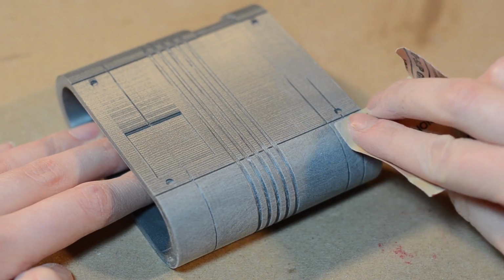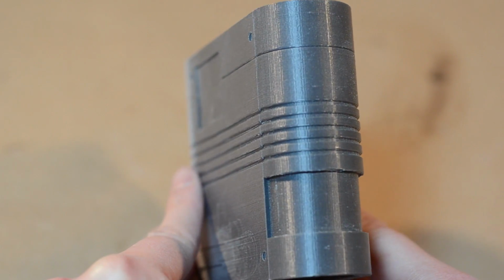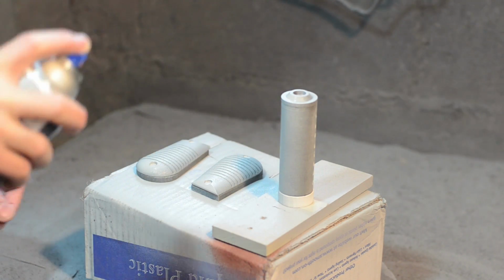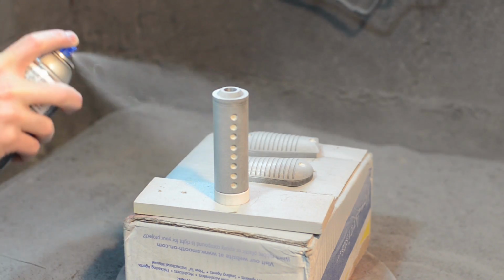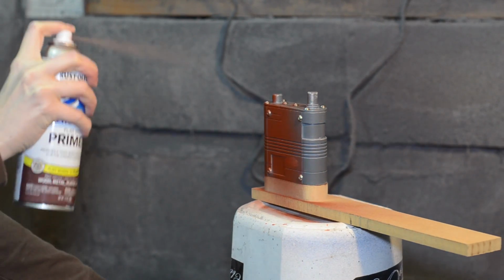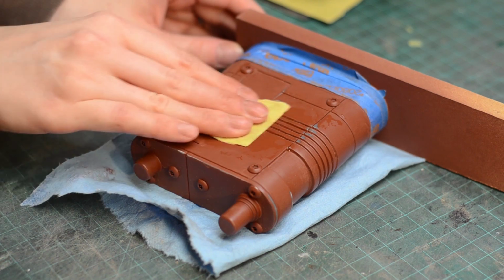Then all of these 3D printed pieces were sanded down smooth with a 220 grit sandpaper by hand. When I was happy with the finish, everything was hit with some really nice filler primer to help remove any remaining 3D printer texture. Then it was all sanded again. And once I was happy with that, I did one more final pass with a normal primer and some wet sanding to get the surface all pretty for mold making.